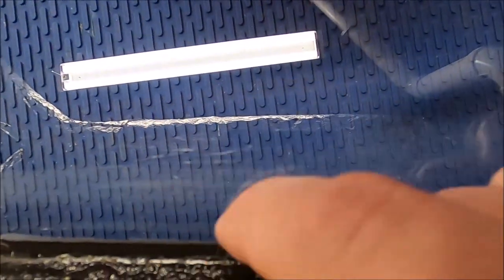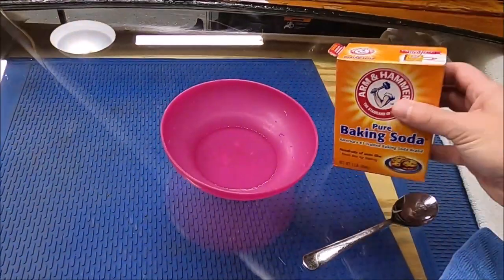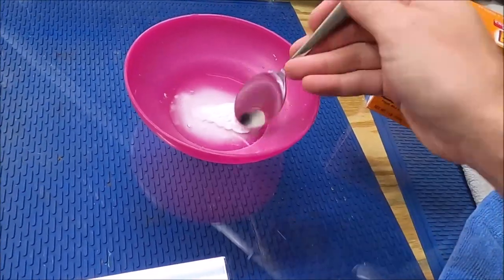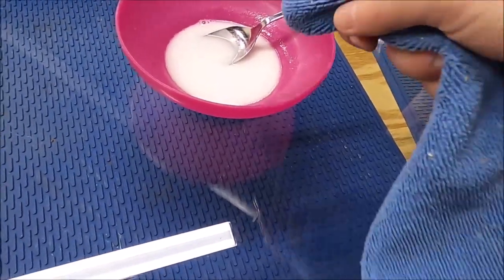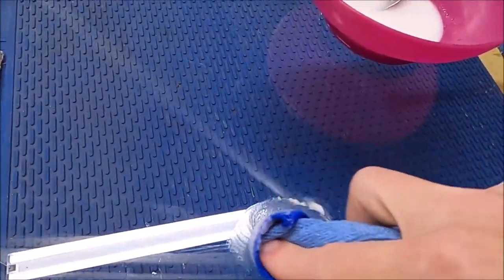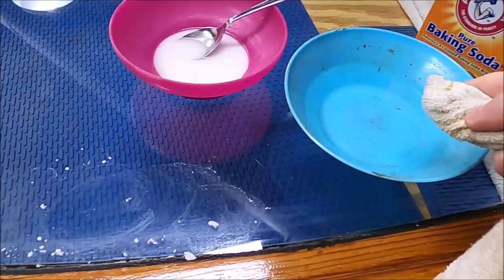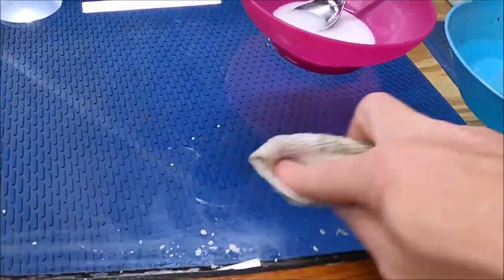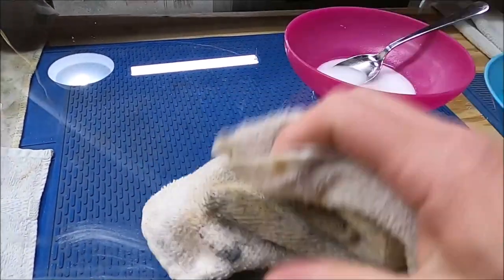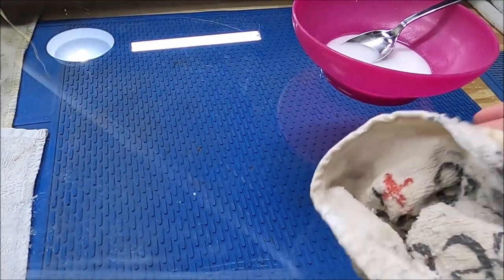The glass had lots of scratches — most of which weren't from me. But there were some that I think I did while sanding. What I'm doing here is mixing up baking soda and water, then taking a microfiber towel to take care of some of the small scratches in the glass. It worked on some — it wasn't perfect, but it was yet another trial and error kind of thing. It's better than when I found it. It wasn't perfect and there's still plenty of marks on that glass, but I don't know another way that's really efficient with my time and money to fix it.